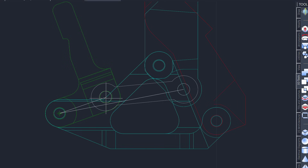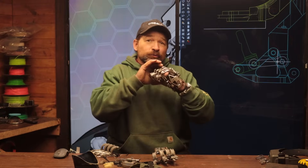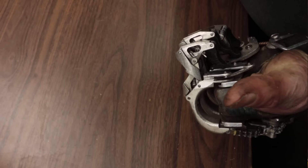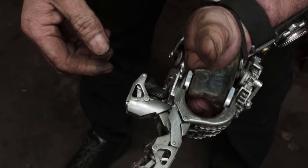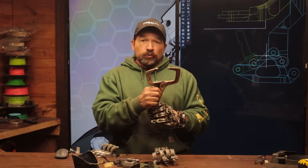So this pin, this pin, and this pin — as long as the three pins are held at at least seven degrees shy of alignment, the finger is able to return from the extended position once the load is removed. Anything less than that and the finger isn't able to return solely from the force of the return spring. This method is similar to how a pair of vice grips work.